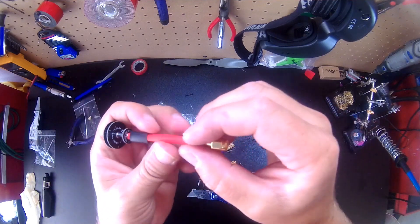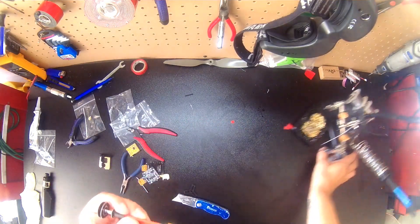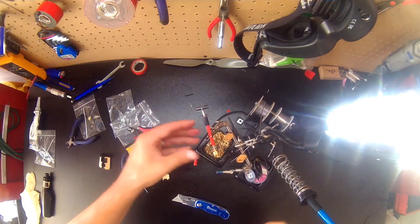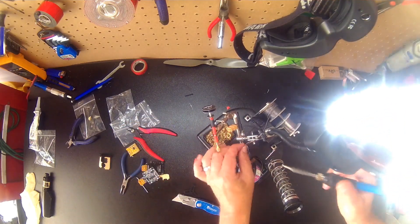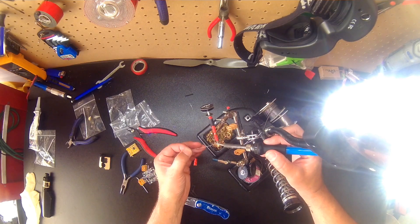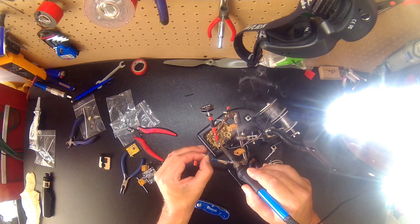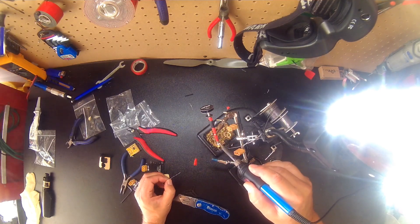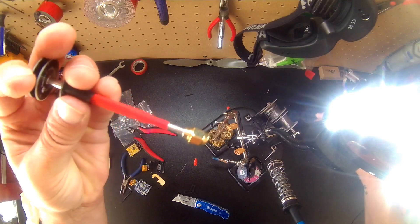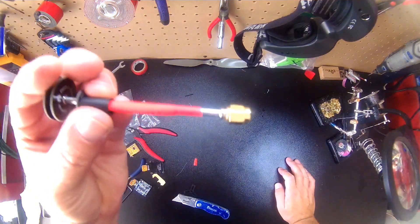Use a helping hand to solder this in. Hopefully we can see this — downward angle, just like you're welding. It heats up very easily, so preheat it. The trick is always preheat and it'll flow right around. Beauty. It's not how much solder you get on — it's where you get it.